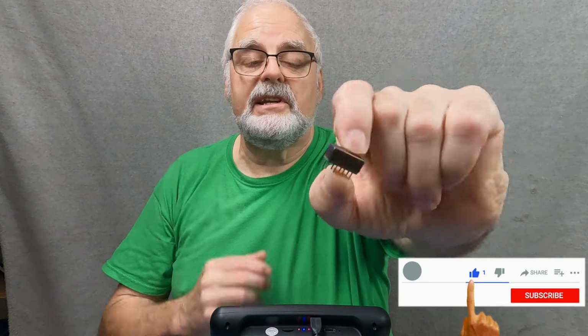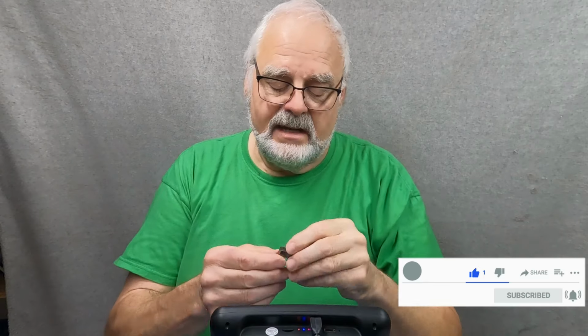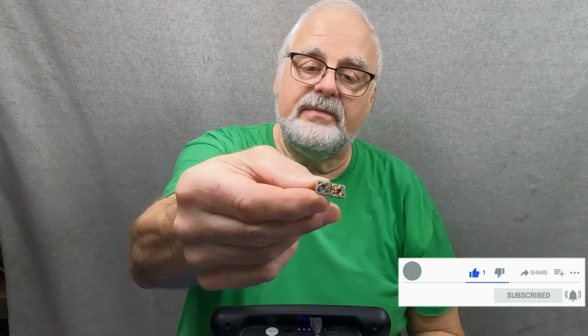Another device that a lot of people out there might be familiar with, and this is not a Mini-Circuits piece, but this is an equivalent to an SBL-1, right? The mixer that's encapsulated. I heated this one up with a torch to pull the cover off. This is a double balanced mixer, all right? And I'll show you what's inside that, and you can see the transformers, the diode pack, and everything.